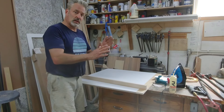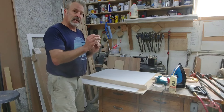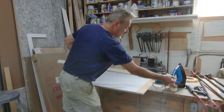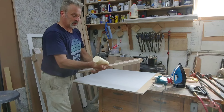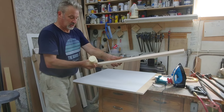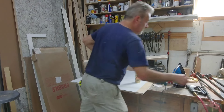There are a couple of little tricks as well. I want to show you what it looks like and how to prep it for paint, but right now I'm going to glue this thing on. Just one bead of glue is good because you don't want to put a ton of glue on here — you don't want to get a ton of squeeze-out. I've just got pipe clamps.